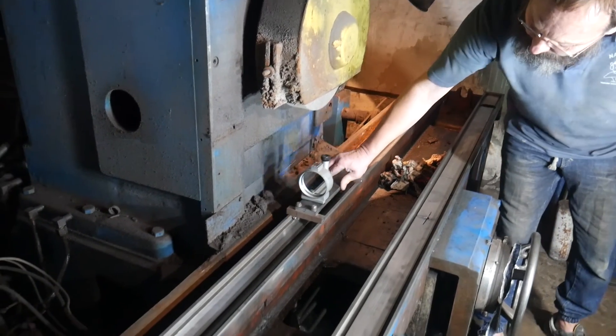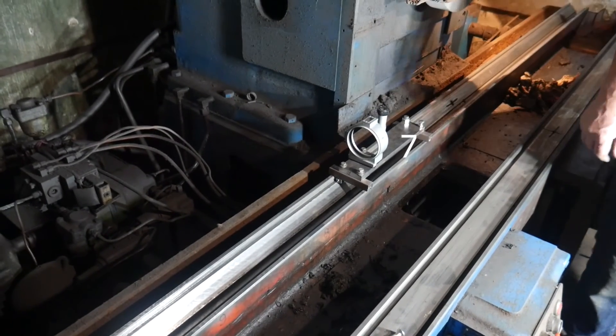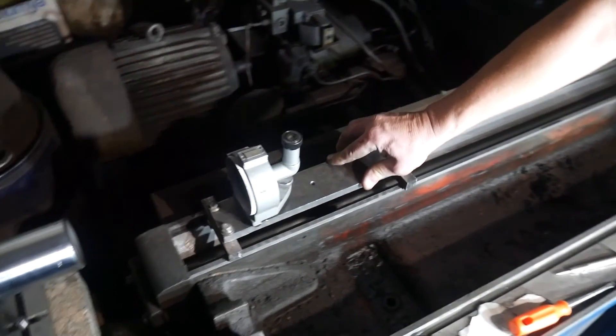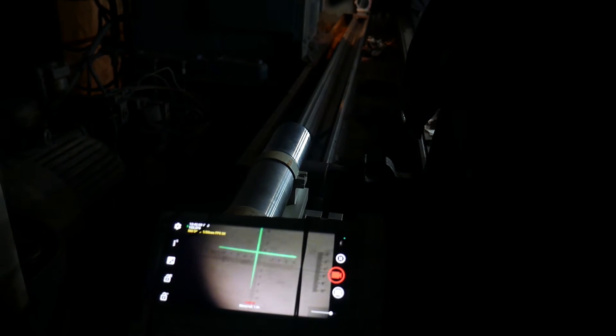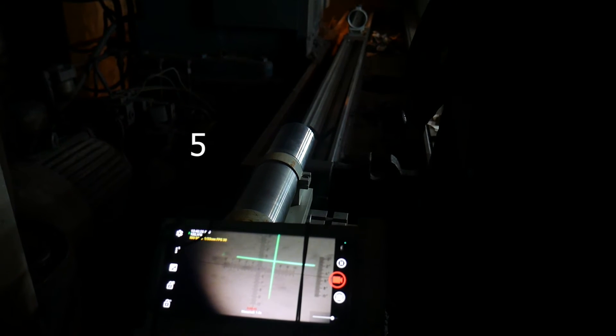Now we will find out whether these grooves can be used as reference linear ones. The first position has the cross in the center, even in the second position. The mirror shows that these surfaces are very uneven and unsuitable for the intended operation. We observe a deviation from straightness even greater than on lines A and B, that is, on the working surfaces of the guide.